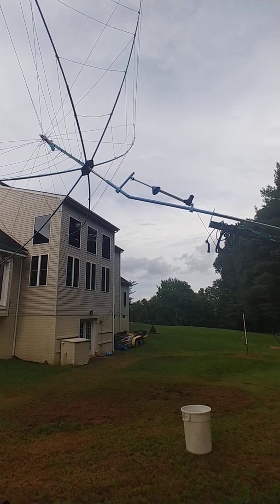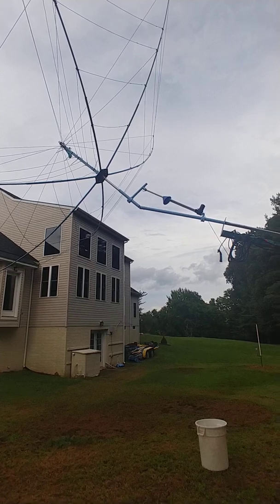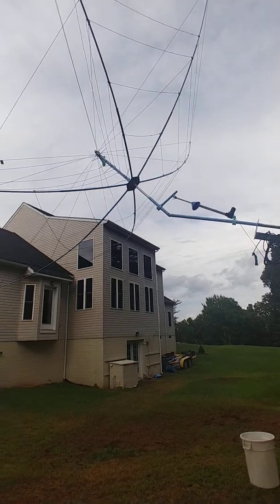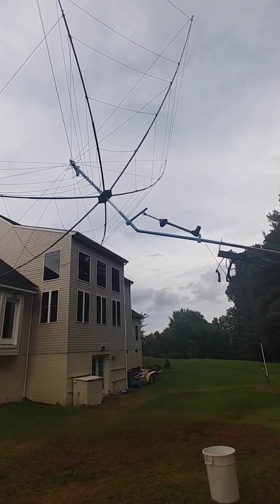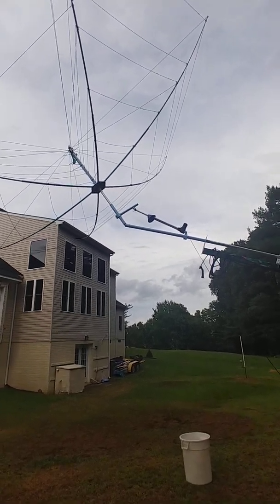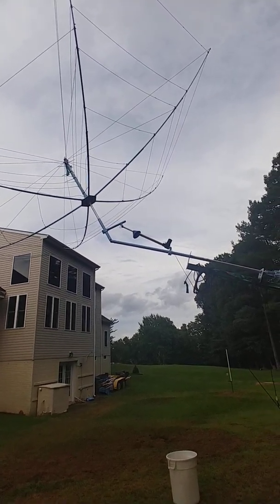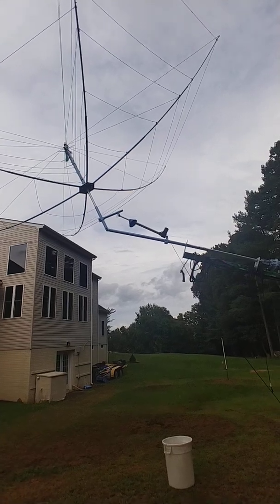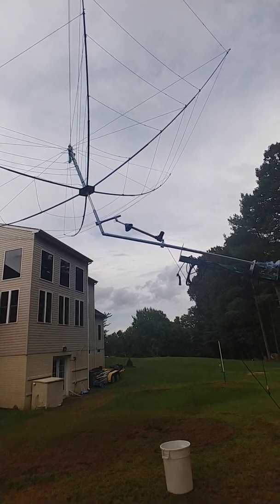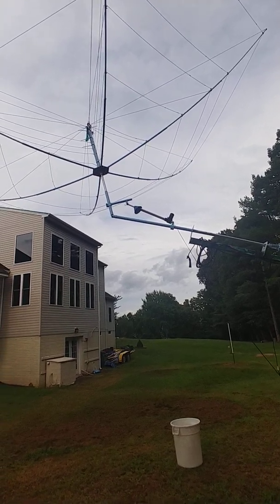It's taken me about three hours to get to this point. I thought there was a short in the linear actuator and I took it apart like 15 times. Finally convinced myself it was working, except it was going backwards. I made the mistake of taking a motor apart without scratching the case — if you don't scratch the case you don't know what you've got — and I got the magnets backwards, so I reverse-phased the DC motor's permanent magnets.